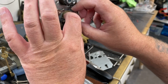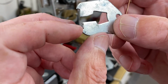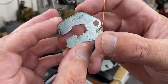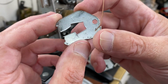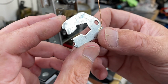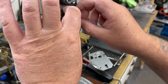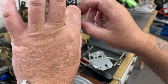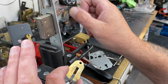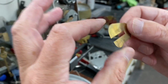So let's have a look at why it was the way it was. So yeah, standard size levers. Got false notches on the bottom, a little tiny one. So we've got a 3, very similar to sort of new Yale style levers. Very similar, but not as deep notches, of course. The first one was a 3. Now it's these spaces, maybe that's why it feels a bit dead there. Possible, you know, there is spring in there. So we've got a space.